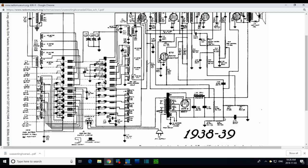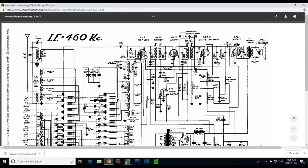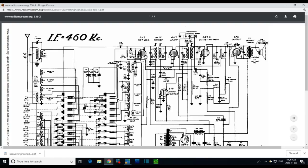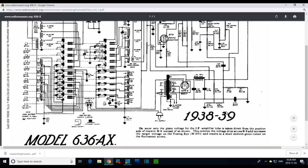Okay, so it's connected right to the, let's call this the negative bus. We'll call that this piece here. So negative from the filter capacitors, negative side of the filter capacitors. So this, leave it at that. So the cathode is solid to the chassis. So how do you get a circuit out of this? So solid to the chassis is here, here.